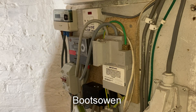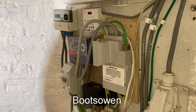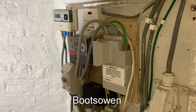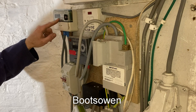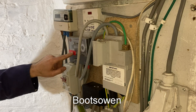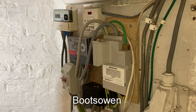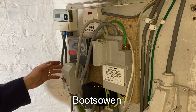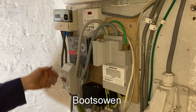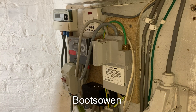I don't like the way they hang there, but that's the way the electric company left them. The screws are in behind the cover and the cover is sealed by the electric company, so there isn't much you can do about it. This meter should just stay as it is unless it goes up when there's electricity being fed into the grid. This other meter should go up from now on really, because it's nighttime but we're drawing very little electricity at the moment. I wouldn't recommend doing this unless you have one of these switches, because a switch like this lets you isolate it. It's risky because I could have nudged that switch by accident and enlivened all of that electricity on this side of it, but I didn't. Questions or comments, leave them below. Thanks for watching.